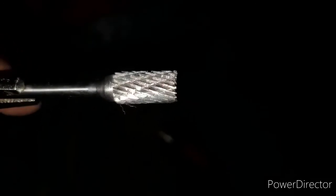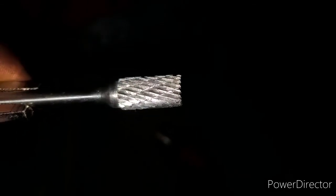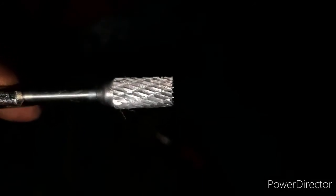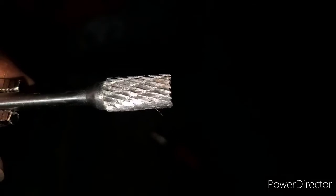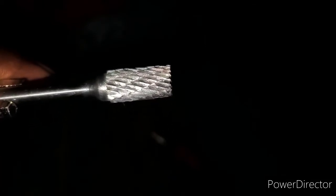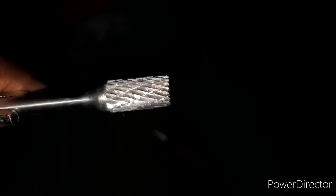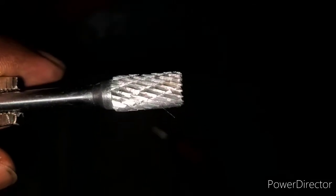So I finally looked it up to see what I could do to stop that from happening, because once it's in there the Dremel bit is basically no good anymore. What I found out was: when you're going to use these bits and cut into a soft metal, you want to spray a lubricant on the bit. Spray a little lubricant, cut for a bit, take it out, spray a little more, go back in, and keep repeating that process — and you won't have this happen.